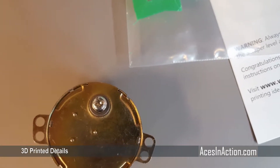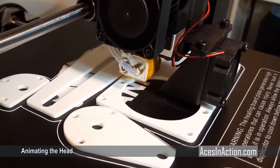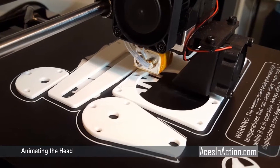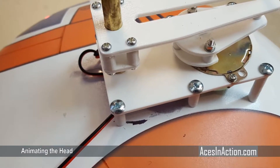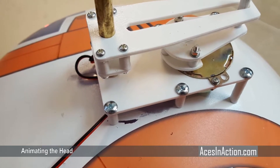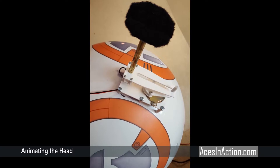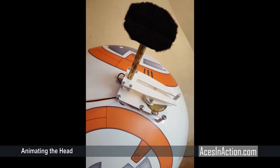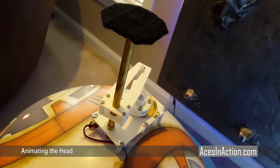In order to make the head turn, I used a small electric motor at 5 RPMs that was set up on top of the body. I used Photoshop to design the gearing mechanism and used that to create the 3D printed parts. The entire assembly was screwed together and bolted on top of the body using a brass rod that was cut to size, and had a flat plate screwed on with fuzzy velcro that would help BB-8's head velcro to the top.